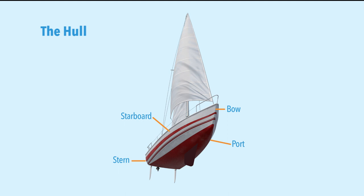On the underside we see a fin called the keel. Not all sailboats use a keel, but most offshore sailboats do. It's used to stabilize the boat. Displacement hulls are very round and smooth — think of a canoe, which also uses a displacement hull, making it very efficient but easy to capsize. You don't want that on a sailboat, so the keel was developed. The keel offsets the tendency to capsize by providing counterbalance. It typically has some ballast in the tip, acting as a counterweight to the wind's forces on the sail.